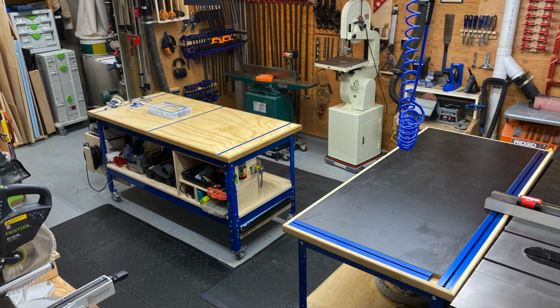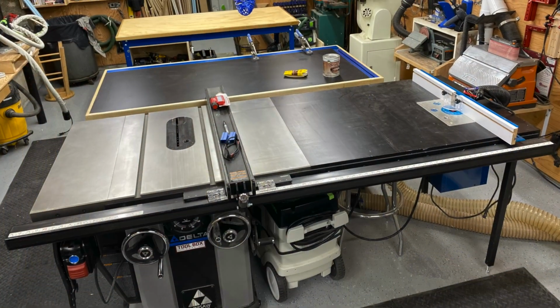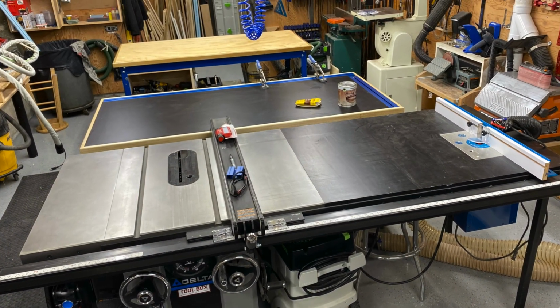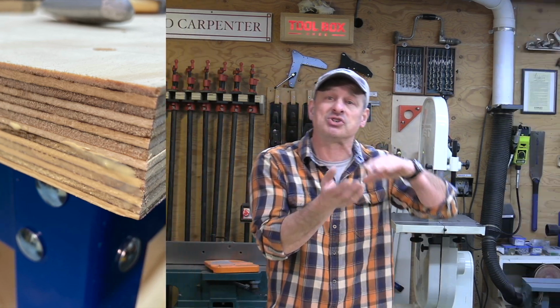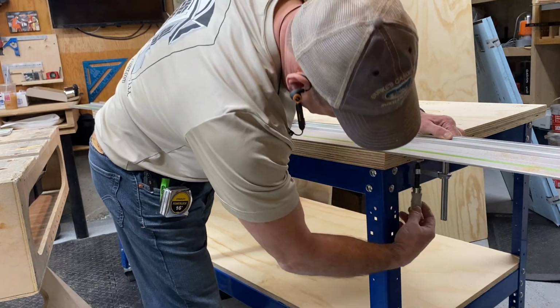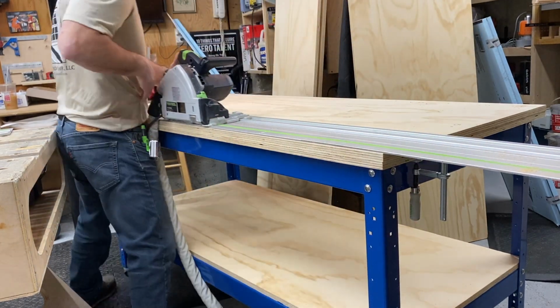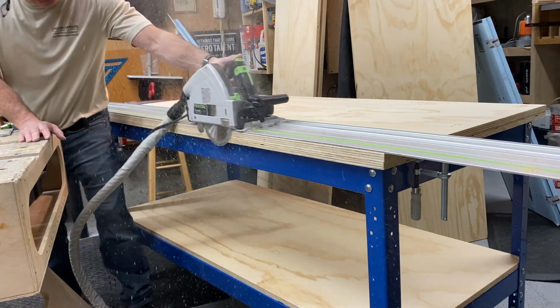And adding an inch overhang all the way around, I took it from 28 by 64 to like 30 by 66. And I like the overhang so I could clamp to it. Now my table saw is 35 1/4 inches high, which meant I needed to be able to use adjustable leg kit to achieve my heights. And with 2 layers of 3/4 plywood for my top, and using those leg levelers, which by the way have a 6-inch adjustment range, I was able to get it an 1/8 inch lower than my table saw. Having both tables basically the same height to me, and being able to make it with sheet stock was desirable. So in the end, I did 2 benches, and they measured, like I said, 35 1/8, which is very acceptable to me. I don't mind that 1/8 dip.